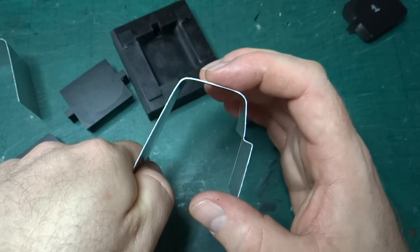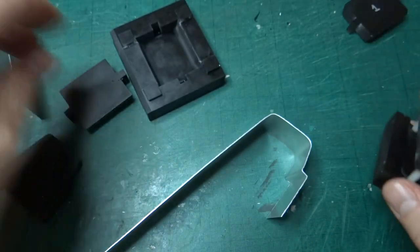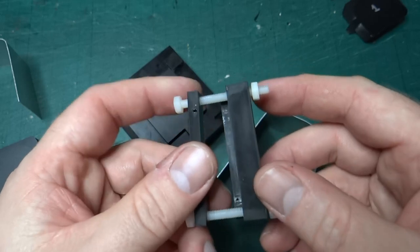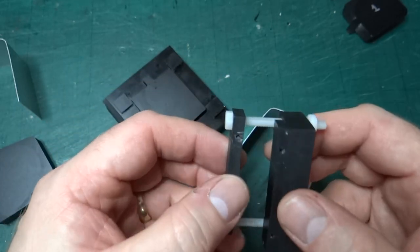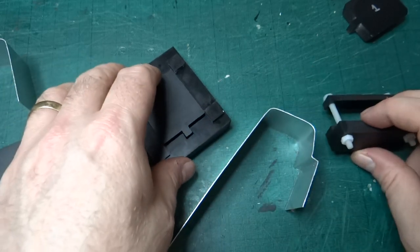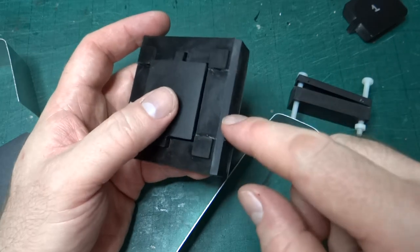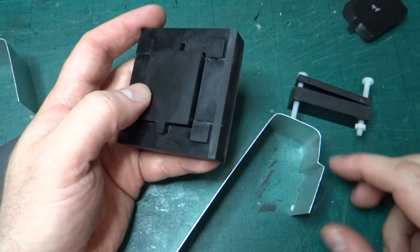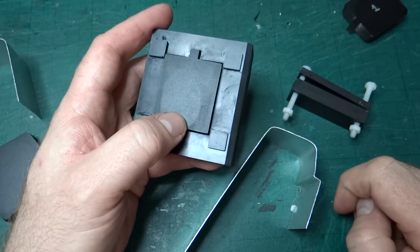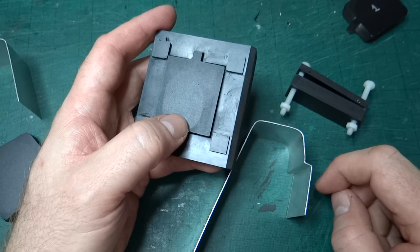Then you'll need to gently massage it to fit. But I'm really quite happy with that — I think we now have the form tool for the top shape, this for the second of the 90-degree bends, to get around the fact that I can't do the initial fold in the brake. And the fact that you do them in order — use the metal brake, then use this tool, then the brake again to finish the form — and then this sets the positioning quite nicely for that second forming action to make sure this distance is correct.